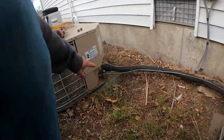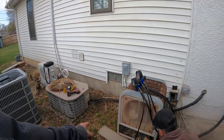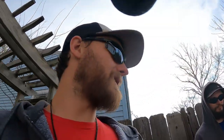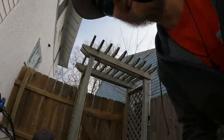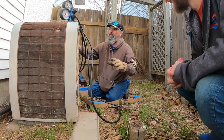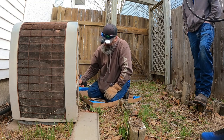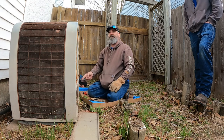Looks like a great home if you're a spider, though. Not losing anything to the environment. We'll check this one over here next — it might have some, but there's only one way to know and that's by putting the gauges on there and reading them. We'll do that after we're finished up with this one. The new unit is gonna sit here and go into the far one, running back into the line set. Coda's got all that stuff ready — I'm supervising.